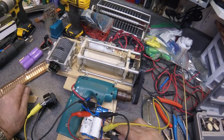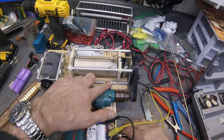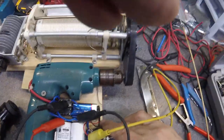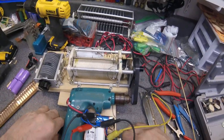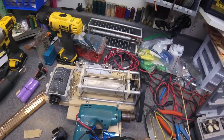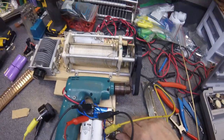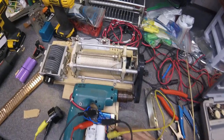Right there — look at that, within a quarter turn. You'll see this trunnion — that's what I call it, it's a post where they terminate the windings — and that's what actually hits the roller and causes it to stop. And that's going to be good because I don't need anything past that. Wow, that's piercing loud! If I'm coming full speed and as soon as I hear that, it'll coast down maybe within an eighth of a turn. That time it actually hit the stop. I may have to put a little extra length on that — you've got to be careful. When I hear that beep, I have to stop quick.